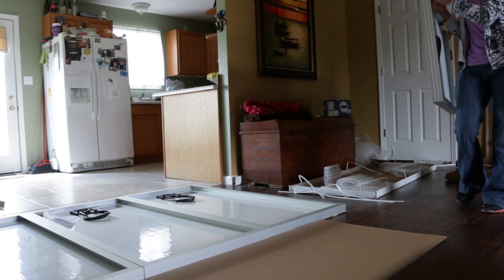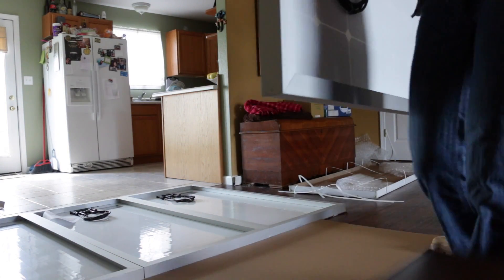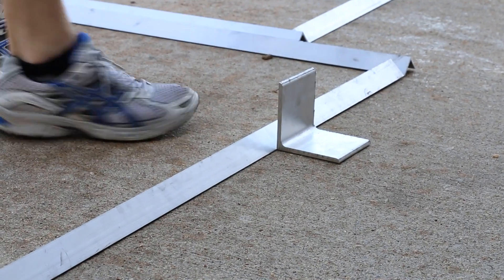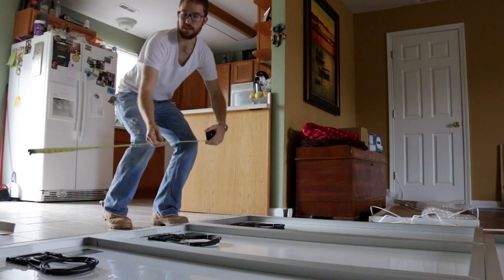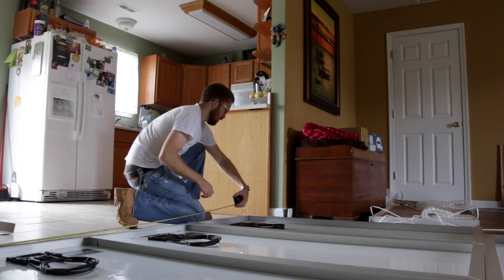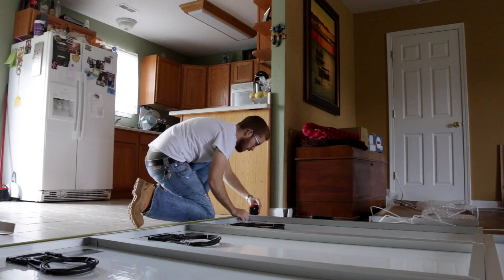The panels that we ordered were actually 150 watt monocrystalline panels. To attach all the panels together, I needed to order aluminum L-channel. I went to a local steel supply company and got the aluminum L-channel the same width as the width of the solar panel frames. I put the solar panels on the floor in the exact way I wanted them to sit up on the roof and measured them so that all the L-channel cut at the steel supply shop would be exactly the right size.